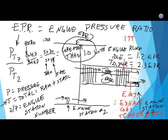There's going to be a set of conditions, and it's going to say something like, turn all the bleed air valves off. Don't run the engine anti-ice, which takes bleed air. Don't run the air conditioning system, which takes bleed air. Don't run the leading edge anti-ice system, which takes bleed air off of the engine. There may even be a circuit pull to disengage one main valve on that engine so that valve stays shut.